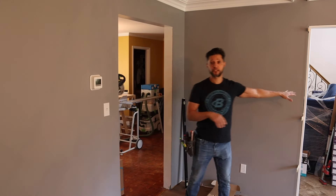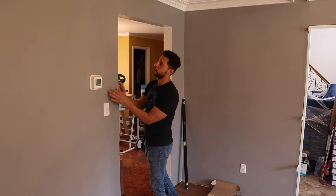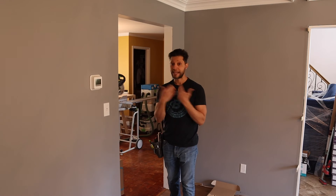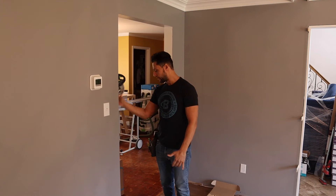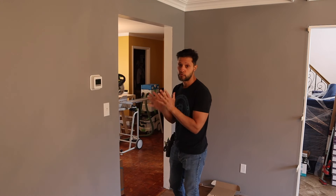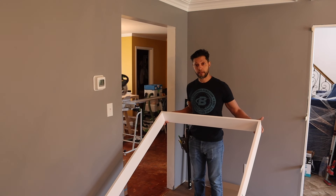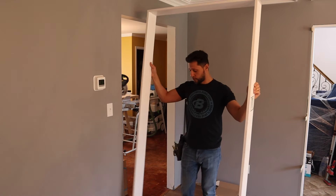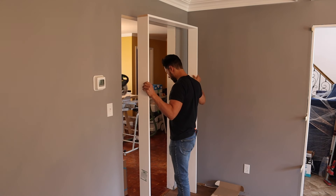You don't have to do this with white trim boards on the inside — you could leave the sheetrock and just wrap your casing moldings around your doorways, leaving the sheetrock inside painted white. Personally, I don't like the way it looks because the sheetrock is never flat — there are bulging screws, brush strokes from the paint, and corner beads that paint will often peel off of. That's why I like to eliminate that and use solid trim boards. I like to put the casing together with one-and-a-half inch brad nails just to tack it together, then put screws through the top so it's all one unit. That way when you stand it up, it already looks like a door casing.